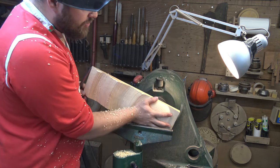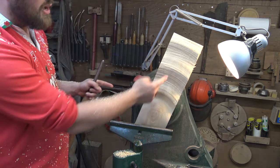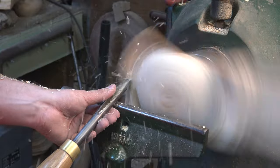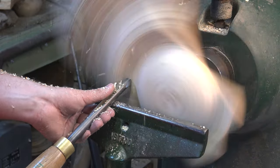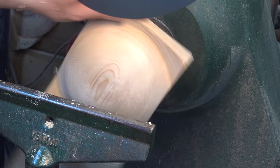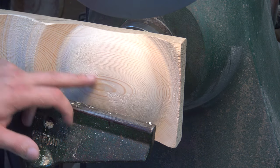I'm just going to establish a little bit more on the outside of this bowl shape now, then put a little mortise in the bottom and have fun trying to turn the top profile while matching the opposite of the bottom profile. This is kiln-dried so you're bound to get some dry bits, but in terms of lack of tear out I'm quite happy. Let's put in the mortise then — I've got a pair of dividers set to the size I need.